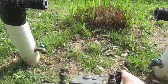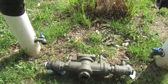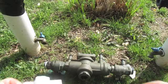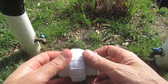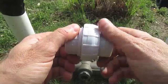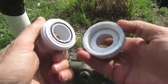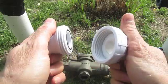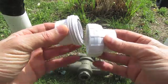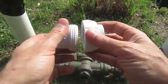I'm tired of these breaking. They get more expensive every year, and the labor gets more expensive every year. So what I'm going to do is install a new one and use what's called a union. It connects two pieces without glue - there's a rubber o-ring here and a flat side, and you PVC cement the two ends. This collar screws on and pulls them together.